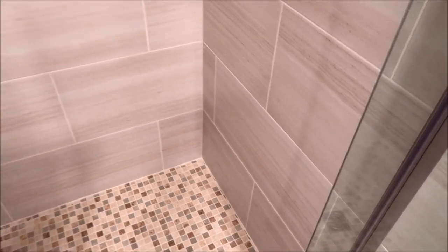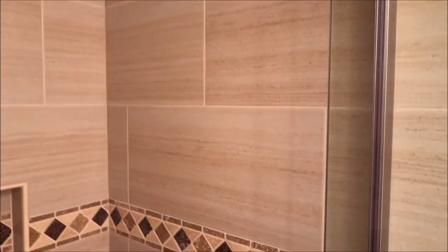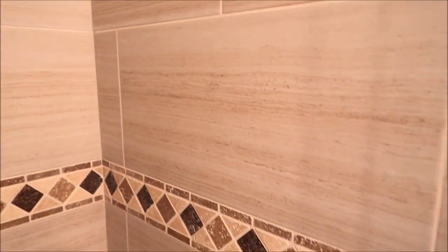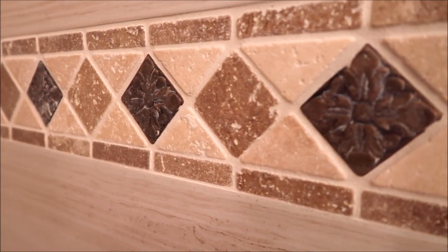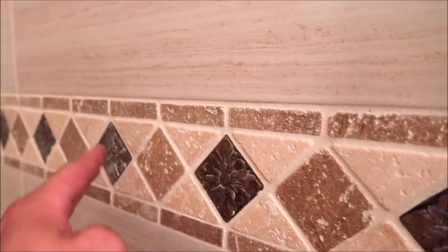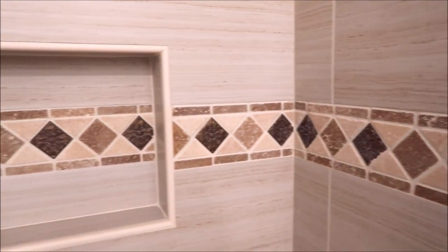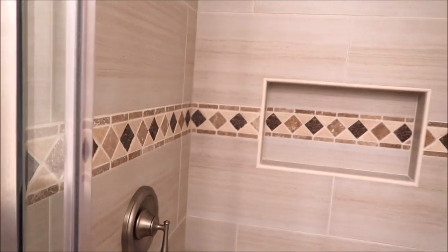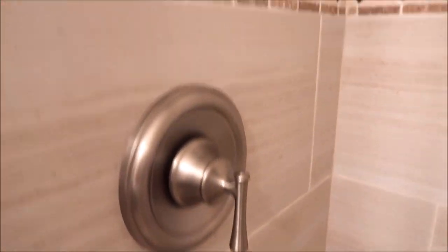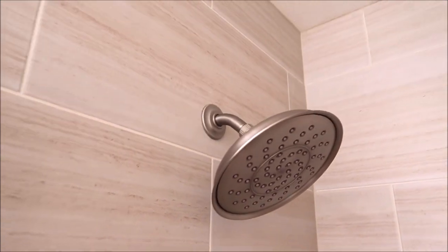Let's talk about the tile and layout. Like usual, 50% offset. Started with grout lines in the middle — everything is symmetrical, all the way to the top. This is a 12x24 non-rectified porcelain. Here is the mosaic inlay — we've got travertine as well as metal-covered decorative mosaic. The stripe turned out nice. We've got a brushed nickel trim kit and shower head. Installed a new valve and raised up the shower head.